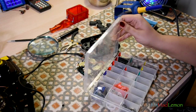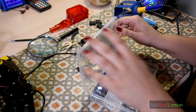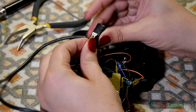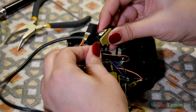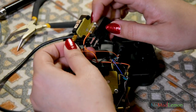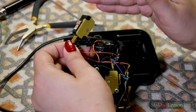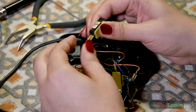So these two substitute transistors, we do not need them — let's put them back. That's the PNP 2N4403 and the NPN 2N4401. First things first, let's replace a fire button microswitch and see what it's like on the joystick tester. The Zippy fits — confirmed! It looks a bit big but it fits. Now be careful: the original one has two terminals, but the newer Zippy one has three terminals. The third terminal is push-to-break, the second is push-to-make — so if you wire it to the wrong one, it'll constantly be firing. Just be mindful of that.